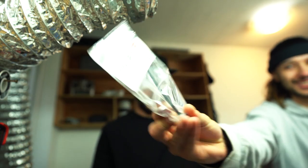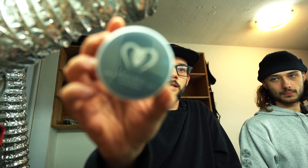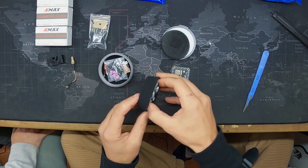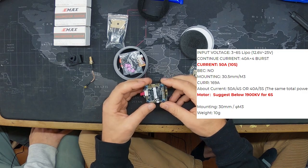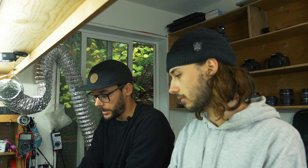We're also supporting a Canadian company, which is nice since we're Canadian. For the flight controller and ESC, we're going with the Mamba F4 stack — a 30x30mm mount. I honestly don't know a ton about it, I just see it recommended a lot. It's rated for up to 6S, so whoever wins this quad could always swap the motors and run it on 6S.